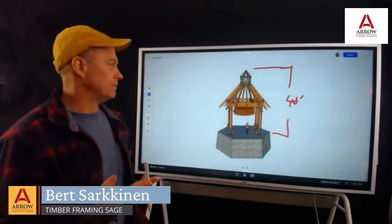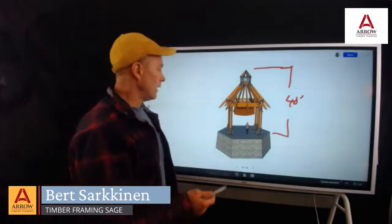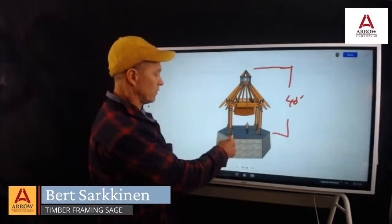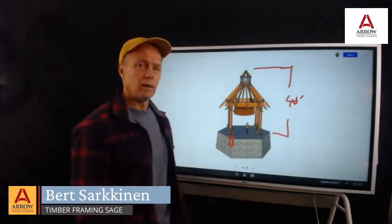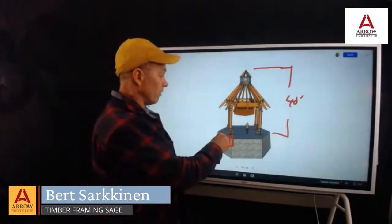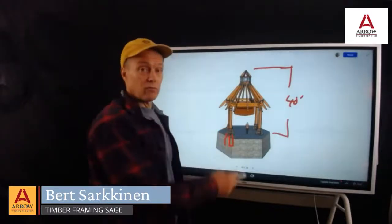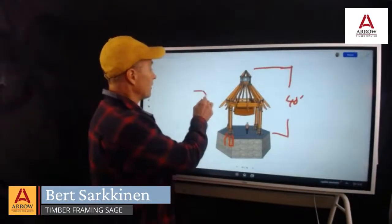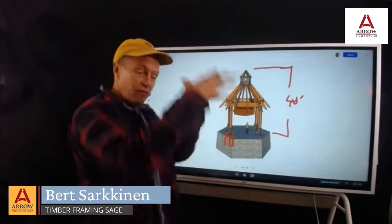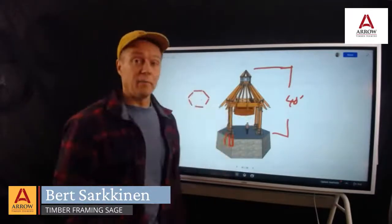And really, it is a glorified pole barn. If these post bases weren't here, these posts could just go down and pour into concrete. What's happening is the steel pours down into the concrete, and then these steel brackets are built like a hexagon. And our posts, we fit those posts into those steel brackets, and that is what's holding that up.